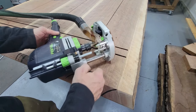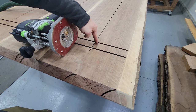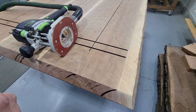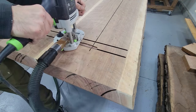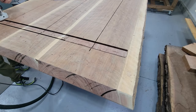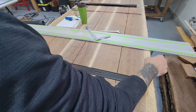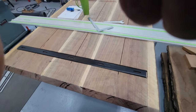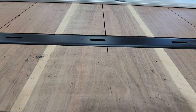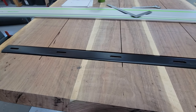I've changed out my bit and now have a half-inch spiral bit in the router. I'm going to use it to trim out this whole area — just careful hand work along these edges — and I'm going to cut out three-sixteenths, which is the thickness of the C-channel. Now we're going to do a test fit. The C-channel fits in nicely, and the point of that notching out is so the C-channel sits nice and low in there so it's not protruding up. The bolt heads will stick up a tiny bit, but not too much. We're ready to put in the brass inserts to attach the C-channel.